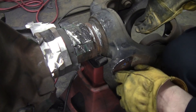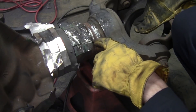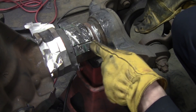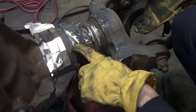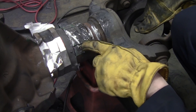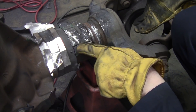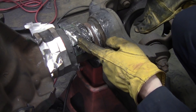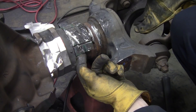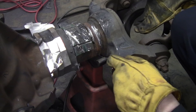So what is the strategy here, at least with the tools that I have? I'm coming in across on either side of these plug welds. And then because the cutoff wheel is round, I can't get into this corner as it starts to trail away. That's basically where I come in at an angle and cut across it. And that allows it to split here and split across that and all the way around. Then I'll come back in when I knock off this plug weld - that part will come easy because that should all be one piece still.